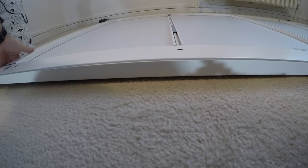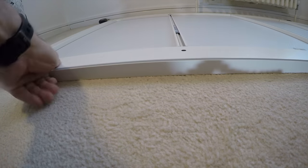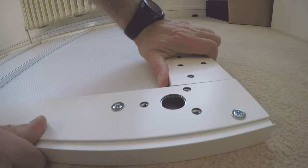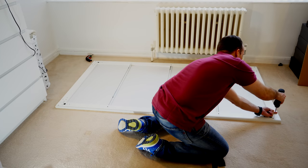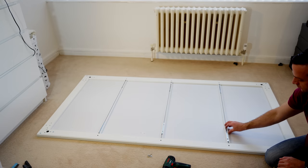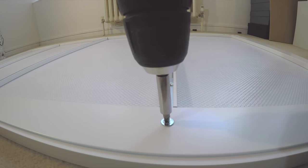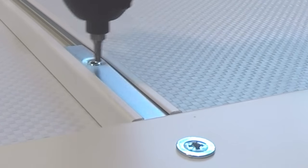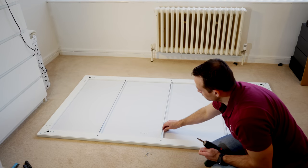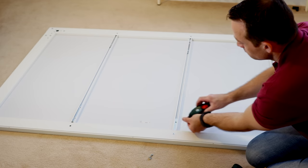I'm lifting the frame up making sure the glass is in the gaps, and then I close the frame completely so I'm not pressing on the glass. At this point I know the glass is in the gaps. Now we have the whole frame together and we can secure it with all the screws — three brackets on one side panel and three locking screws, so one screw on the side panel and one locking screw per bracket.